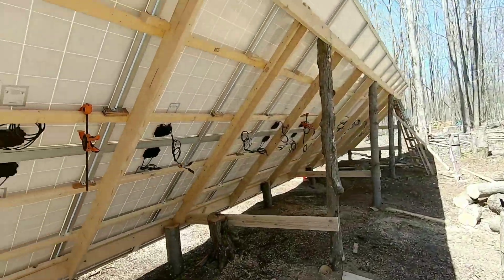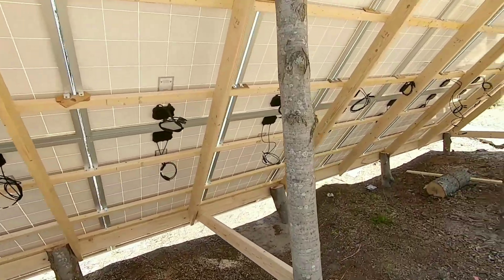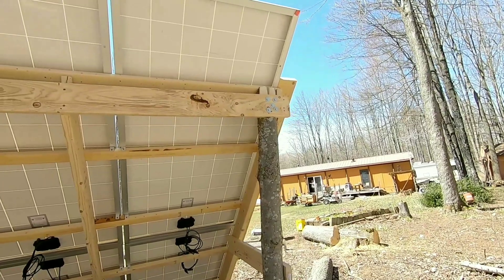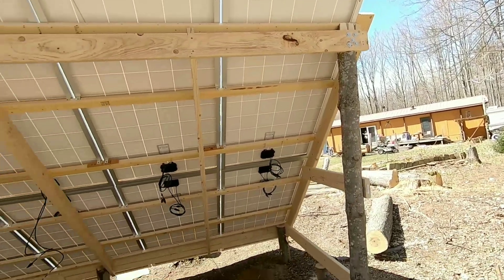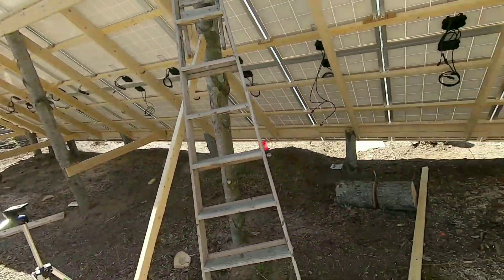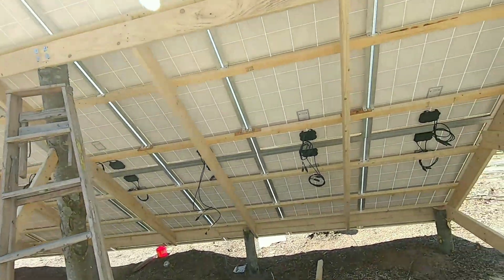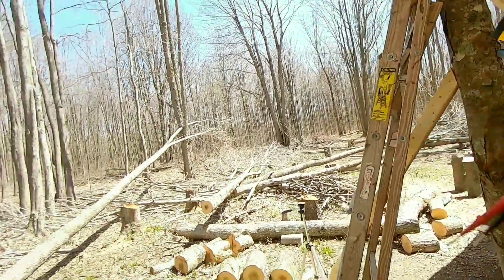I got a couple more lags to do. I started securing everything with lag bolts, and what looks kind of funny — one of them broke. It's still in there but it broke, so I ran one in the center there. I'm going to run a crossmember from over here to there so the rest have one. Everything's secure and solid. I just want to get these lags the rest of the way down, and then I'm going to run another two-by-six underneath from post to post — it'll give it a scissor action in case anything comes loose.